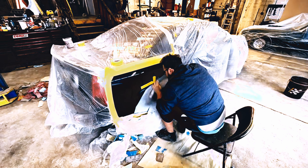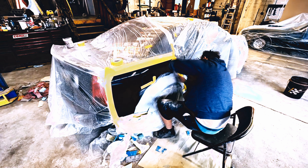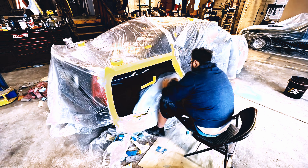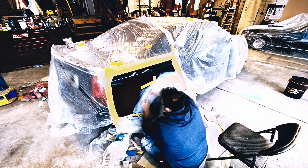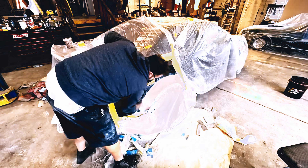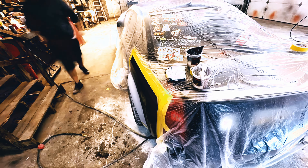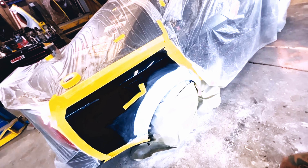So this was actually the next day — I let it sit and dry and it was so much better after that. Worked flawlessly, to be a hundred percent honest. So if you're ever going to do this and start using primer really thick, let it sit overnight. It's just the smartest thing to do because I finished sanding in about an hour.